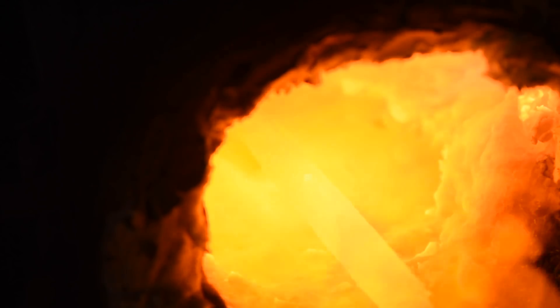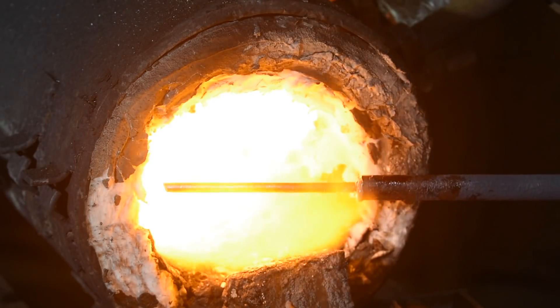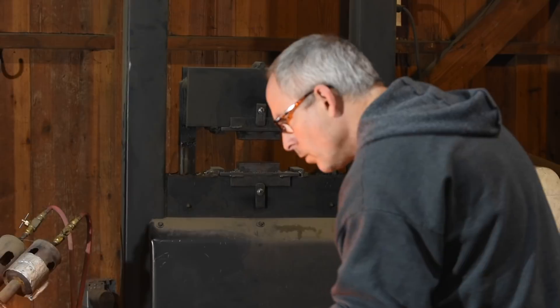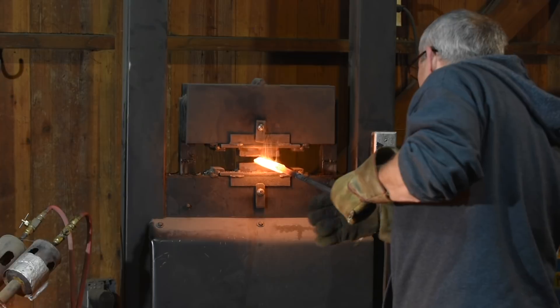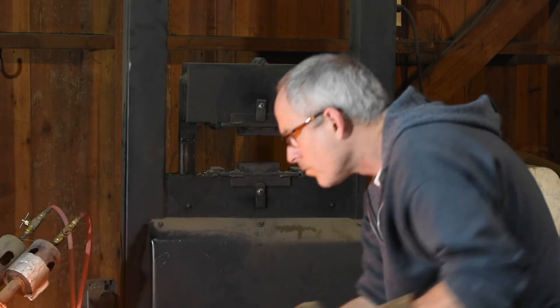Now comes the fun part. I'll begin by heating both my tube and rod, then dusting them with borax flux, which will help clean the welding surfaces and ensure a good weld. It's a little tricky getting this to work because the rod's expanded from the heat, the flux is messy, and the steel's softened a bit. Ultimately I had to get off camera, but eventually I was able to wrestle the rod into the bore. Before forge welding, I'll lightly pinch the tip — I don't want it welded shut at the beginning because that would trap the flux inside, causing inclusions that would mess up the weld. I want it all to squeeze out before it welds shut.